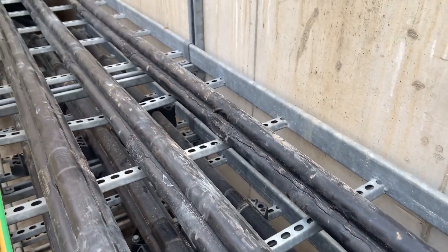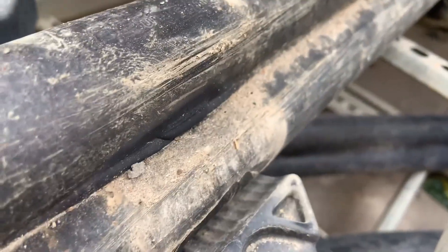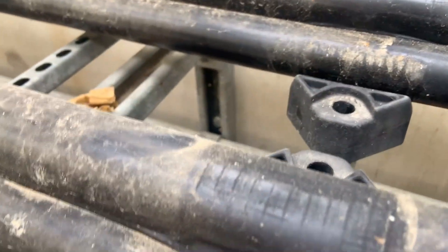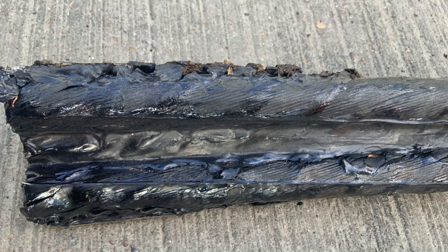It's not possible to inspect the condition of the cables within the six separate ducts embedded in the concrete. But based on our findings within the cable trench, we would assume that the lack of cooling in the ducting would cause even more damage to the cables. In summary, where the cables are exposed to free air movement, the cables show no sign of damage. But within the concrete trench and within the cable ducts themselves, the cables have started to melt.